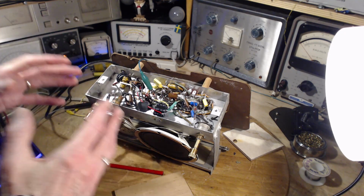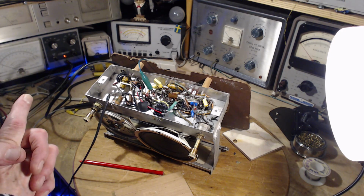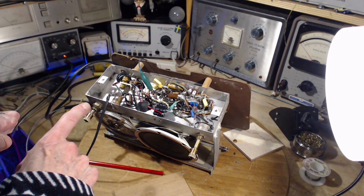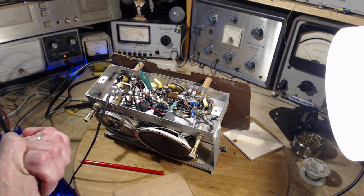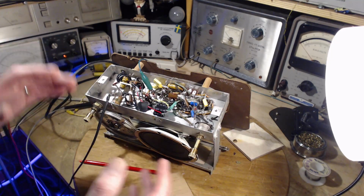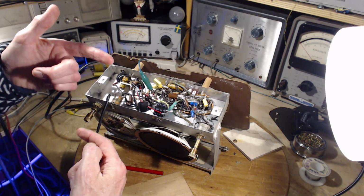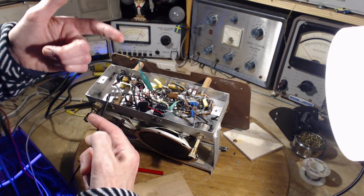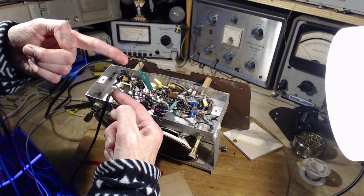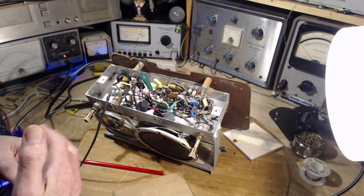Generally, I think if you manage to get an accidental signal into the IF somehow, it's going to heterodyne with the tuned signals coming from the antenna. And you're going to get a pitch howl that's going to go up and down as you tune through stations, showing you that maybe the IF itself is oscillating. So it's oscillating away at, say, 456 for some reason. As you tune through a station and a new 455 comes in, as you tune in, 453, 454, 455, would mix with the accidental signal, you get a 1,000 hertz tone, and as you tune through, you get that woo sound. Don't hear that at all.